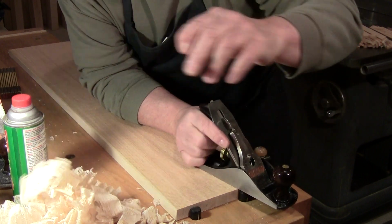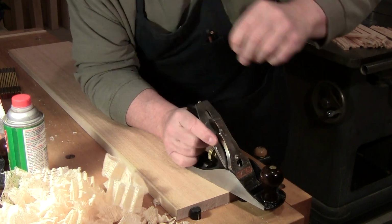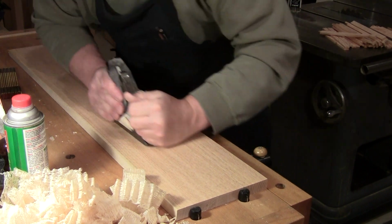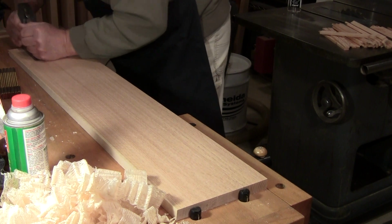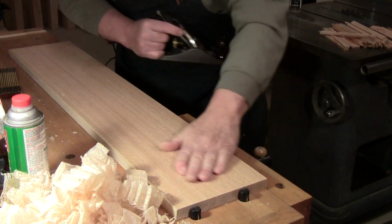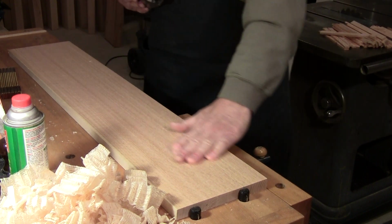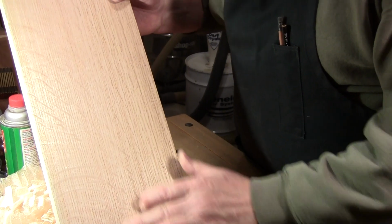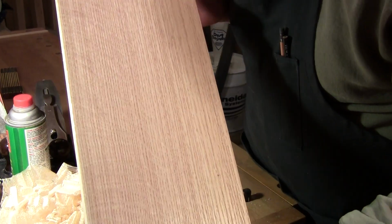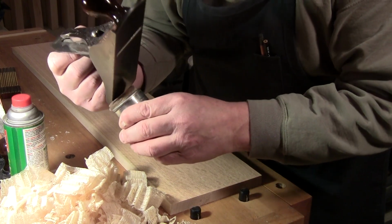on green wood. And each wood is different. Oak, flat sawn oak is not quite as bad as quartered. The quartered, you have all those rays, all the ray fleck to deal with. Look at that. Absolutely beautiful. So, super sharp. Now, that's done. C'est fini. Okay? Look at that grain pattern in there. Can you see that? Too bright? The light too bright? Let's try moving it over this way. Immediately upon completion of your planing, lubricate.